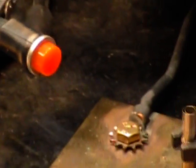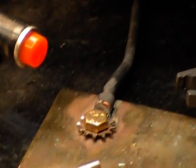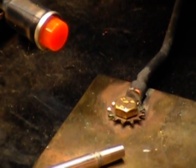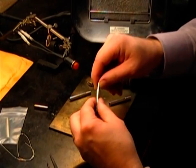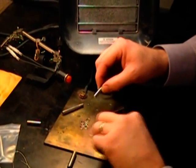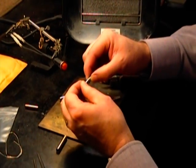Now, should we turn up the power on that? With the test and evaluation we're doing, everything's trial and error — and it's the same thing for the end user. They can by all means adjust the heat up, which will speed up the process or lower the dwell time. The problem with that is if you go too high, you can end up with a score mark, a burn mark, or thermal discoloration of the materials you're working with. Sometimes that makes a difference and sometimes it doesn't.